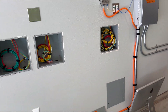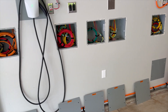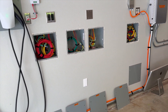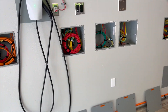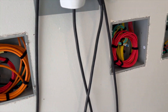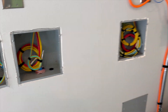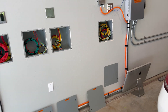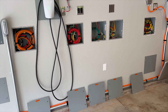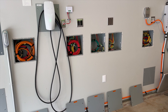The idea here was really to have as much flexibility as possible. I didn't really know what I was going to need, so I wanted to make sure I had plenty of capacity coming from the road into one location and then from that location to a couple of different paths to other parts of the house. If you're planning a build, it's nice to do these boxes above the conduits, have the conduits installed in the concrete, and then have them piped up into the boxes — that makes it easier to pull wire. There's some pull string that goes all the way to the road, and those are a good way to have multiple things coming from different sources, neatly tucked away in the wall.